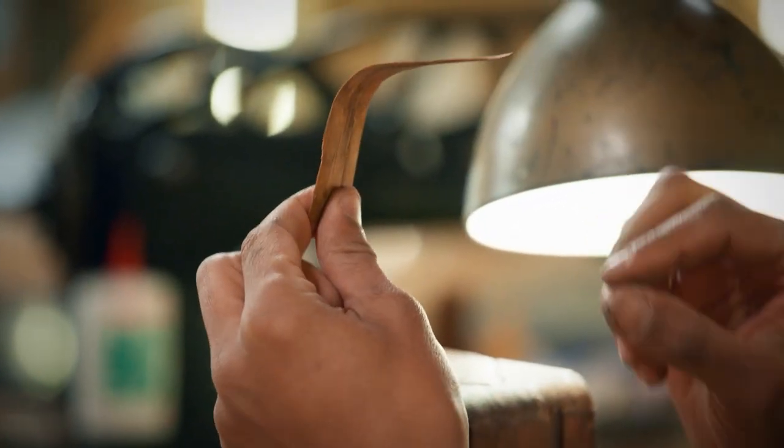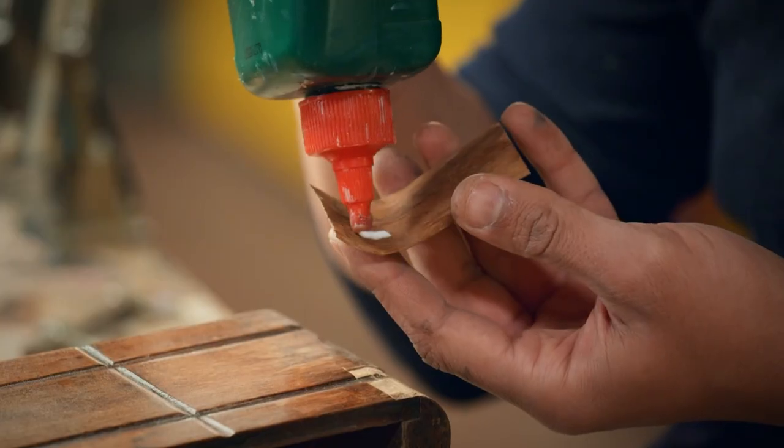I've taken off the clamps and the wetting and the clamping of the veneers really worked out well. There's a great sort of L shape there. I'm going to glue that in with some wood glue now, with some clamps and a few blocks of wood. That will keep it in position whilst it dries and prevent it from peeling back out into that flat shape again.